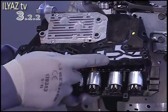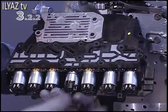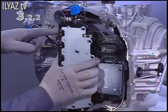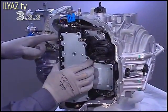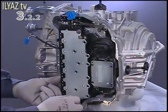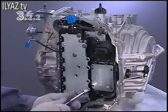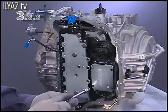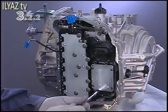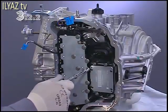Install a new filter panel in the control valve group in order to avoid fluid leaks behind the seals. Install the control valve group along with the transmission control unit, and tighten the bolts as specified in the service literature.